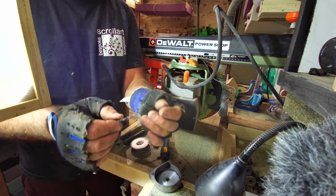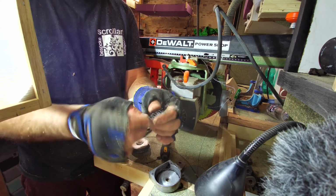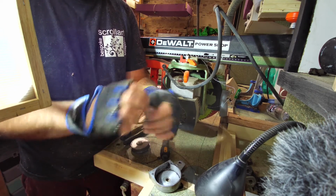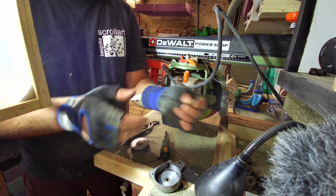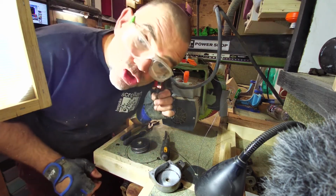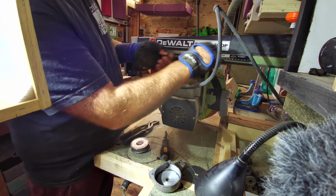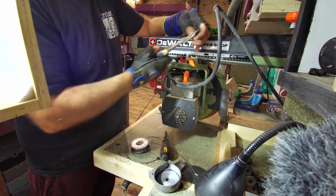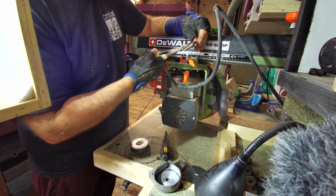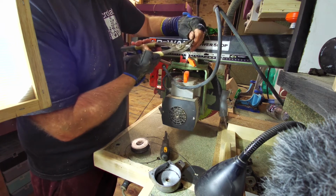And that's basically what's called the jam. So it isn't because the spring's broken or anything. It's just that the Bowden cable has basically frayed or broken a bit longer and caused this weird kind of jam. And then we've got these two little locking pieces which would need to go back on. I've got a feeling that we might be able to fix it. I'll be so pleased if I can, because it does work really, really well.